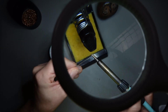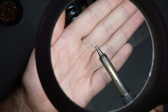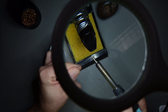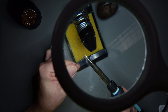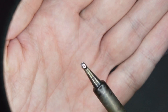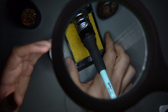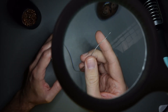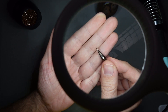It's important to add some solder on your tip. You see how the tip now is — the color of it is a bit dull. It is shiny, but not as shiny as I would want it to be. This is going to help me keep it in good shape for a longer time. So every time that I take a break, I'm going to put a blob of solder on it, and then put it in and turn it off. This blob of solder helps protect it from oxidizing. Metal gets oxidized, and the way to avoid this is to keep our soldering iron wet with some tin on it at all times. Keep that in mind, because this is what's going to help you avoid burnt soldering tips.